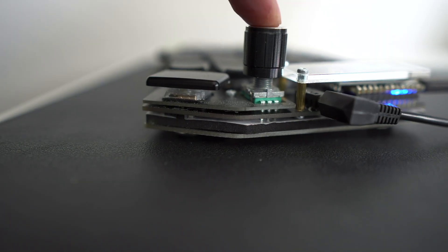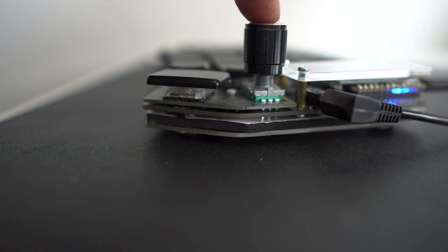I tried 4mm standoffs to lower it down but that was just a bit too short. I think 6mm is about the sweet spot. I also tried cutting a layer of Sorbothane to go between the plates to try and make the acoustics a little bit better. It hasn't made a tremendous amount of difference to be honest, but I suspect if this was enclosed in a plastic or aluminium case the Sorbothane would probably help more. One thing the Sorbothane did help with is when pressing down on the rotary encoders — the PCB was flexing quite a bit when pressing down, and having the Sorbothane underneath gives it a little support, so I've kept it in for that reason.